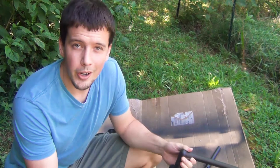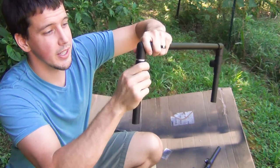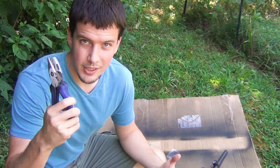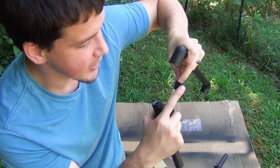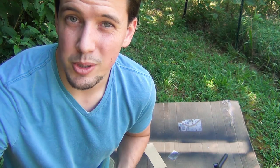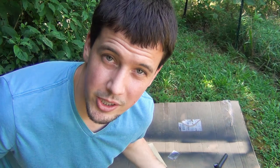Before you glue, you need to do the same roughing-up-the-edges thing we did before painting. I'm going to take these connectors apart — grabbed some pliers for that. This is what one of our corners looks like: the top piece, the connector, and the opposite leg. We're applying glue to the outside of the connector piece and to the inside of both pipes. The PVC cement is some pretty intense stuff, so once again make sure you're in a well-ventilated area. I'm doing safety glasses and gloves.